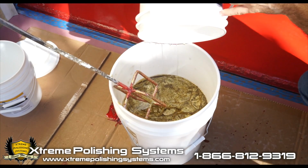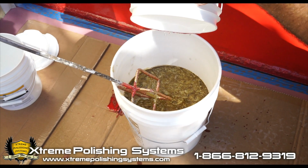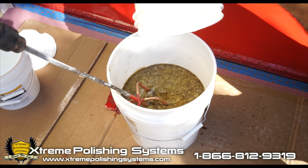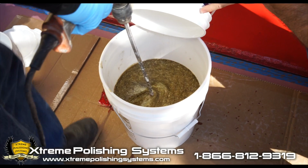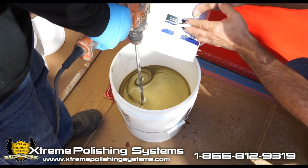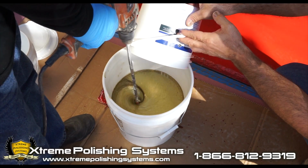And that's our hardener. It's really important that you don't mess these things up because otherwise your floor may not harden properly. And then you got a problem on your hands. So make sure you use all the 2 parts A and the 1 part B. And now we're going to mix it for a full minute.